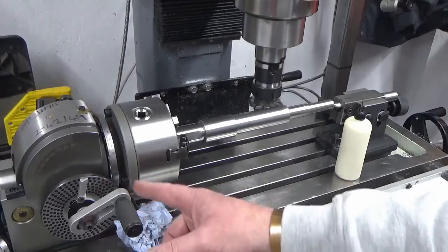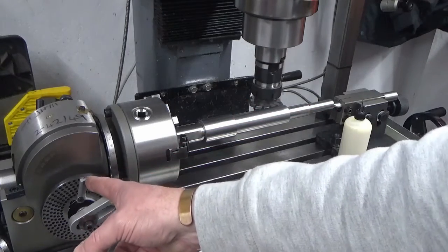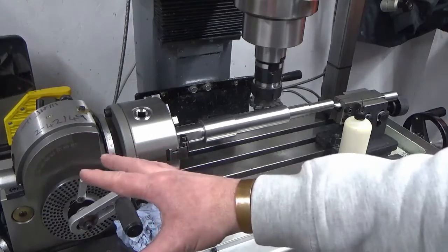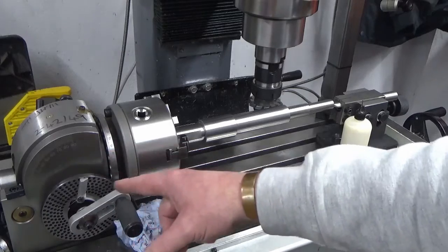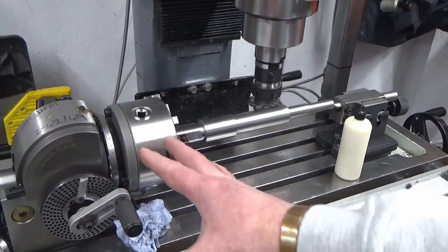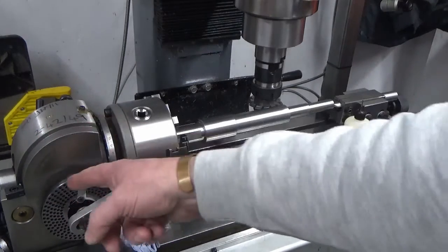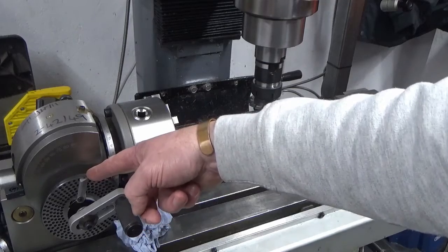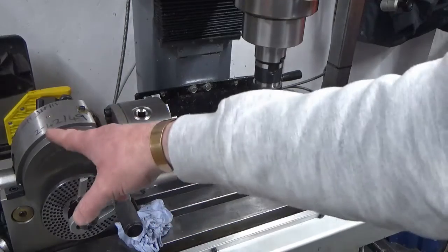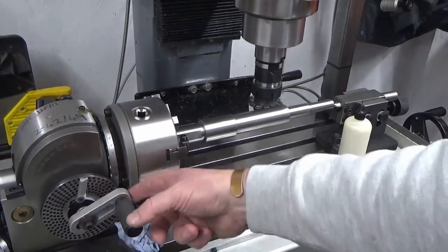winding the handle clockwise for my increments, but I was winding the sector arms counterclockwise. And lots of people were saying that that's really strange, you shouldn't do that, you should wind the sector arms in the same direction as your handle, and that's how I thought it was. So I've just done a double check, and with the sector arms I need to get 42 holes on this 49 hole plate, and with the sector arms fully open in the widest position they'll go before they lock up, I can get 38 holes on the 49 plate. So clearly not enough in between the two sector arms.